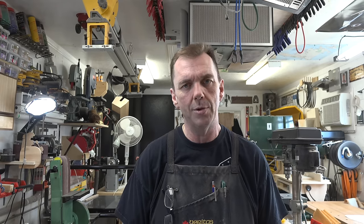The other thing to keep in mind is blade drift. If you were to put a fence right here and push this piece of stock gently into the blade and start cutting, the blade would not cut straight. Scroll saws have blade drift — they will veer off to one side or the other, whether it's a fifty-dollar scroll saw or a two-thousand-dollar scroll saw. That is the nature of the beast. So the entire time you're trying to cut a straight line, you need to be steering and compensating ever so slightly, pivoting so that your blade's cutting edge continues on that straight path.